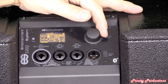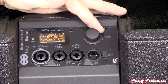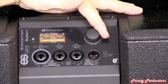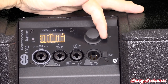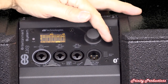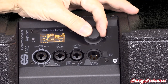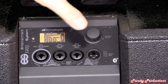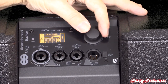You can set gain level for each channel, adjust EQ, high-pass filter, and anti-feedback filter for each input. You can also see how much each channel feeds to the aux mix output. Scrolling through the system menu you can see the beam tilt options: a little tilt down, straight out, or a little tilt up - you select it and hit enter.